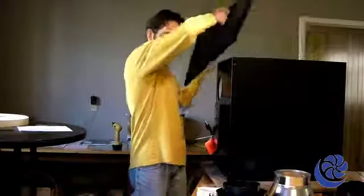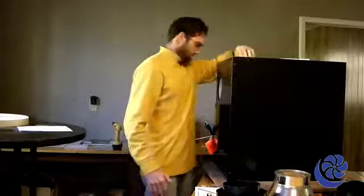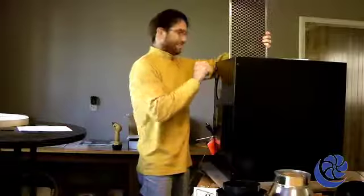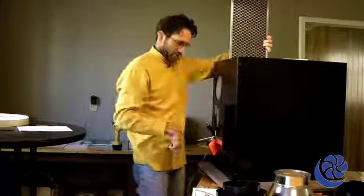Our manual dictates some clearances around the unit in several directions. There are no hazards associated with the clearance recommendations. The one clearance, which is directly out of the top of the unit, must be maintained because you have a filter that is 24 inches long and you must have that clearance to get it out. So you must have this 24-inch distance from the top of the unit.